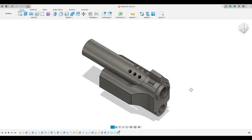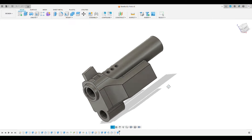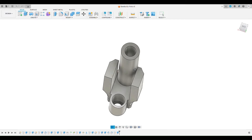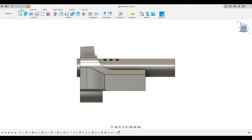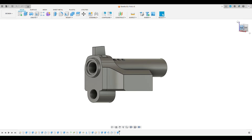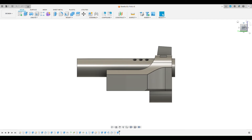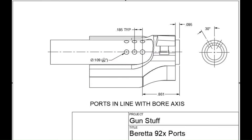I made a 3D model of the barrel and slide. I won't be machining the slide, however I wanted to figure out what would look best with how the slide is cut. I don't care about fouling out my front sight because I run a dot on this pistol, so the V can be a narrower angle with more vertical ports so the gases contribute more to reducing muzzle flip. I settled on a V6 port with 7/64th of an inch diameter holes, 0.185 inch center spacing, 30 degrees off the vertical, and 60 degrees between ports. It's almost quicker to make a 3D model and derive a drawing from that than sketch out a drawing by hand. I always like having a nice clear drawing to reference when machining.